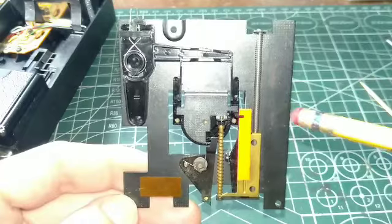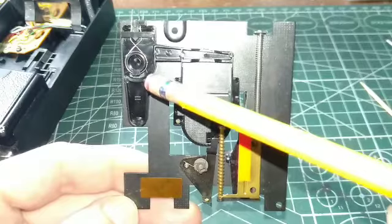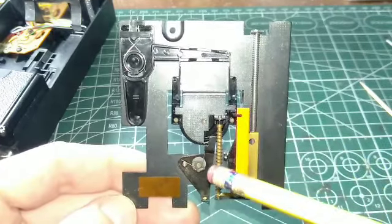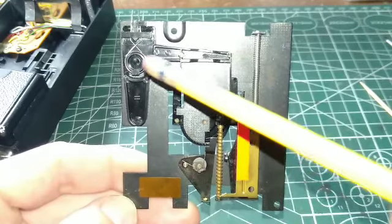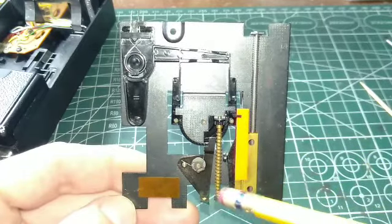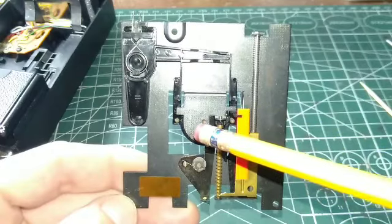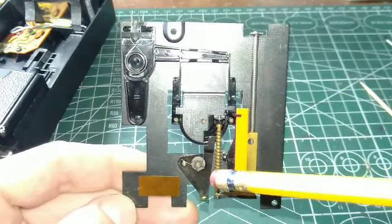Everything here seems to be essentially clean. There's a tiny bit of surface rust right here. One important thing: you have very thin, flimsy plastic springs right here — take caution with these any time you work on a Bolex. They can pop out and become lost in the blink of an eye. You may want to tape over them. Take photos of the springs, and know that you can remake them using thin guitar wire if needed.